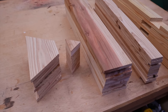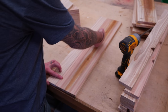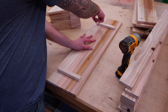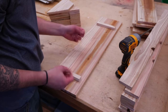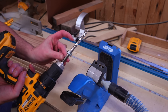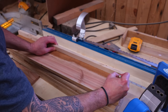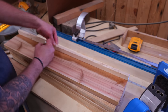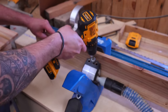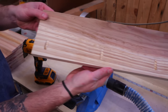Now we have all of our parts cut, so let's go ahead and put this thing together. We're going to start with our side walls — there are a couple of different ways you can join these. You can take a couple of pieces of scrap and screw those in, or use pocket hole screws for a really sturdy result. Since my material is closer to a half inch than five-eighths, I'm going to set my bit to half inch. Here's a tip: take a piece of scrap wood, put your screw spacing on it, and use it as a template. I like to put my pocket holes one inch from each end and then six-inch equal spacing for the rest.